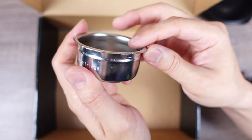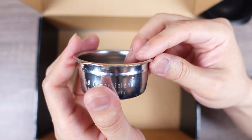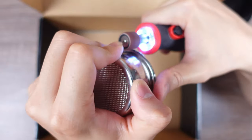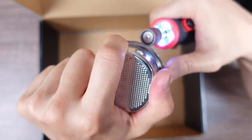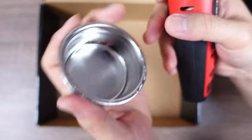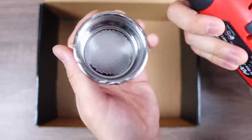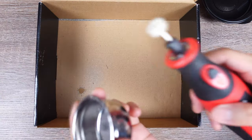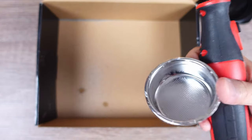Hopefully this shows up on camera — after one pass with the sandpaper buffing bit, it's already looking a lot cleaner. A lot of the more jagged edges are gone. I'm going to go through one more time with a finer grit to clean it up further. Just something to keep in mind: the bit set I'm using is not great quality — it's quite cheap, and just a little grinding already ate through most of the sandpaper bit. But it did its job. Lastly, my kit came with a wool bit meant as a final step to buff the metal, so I'm going to run it through one time.